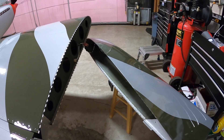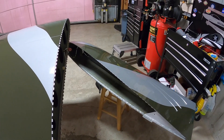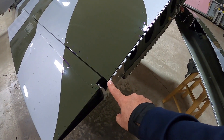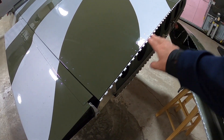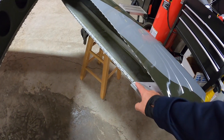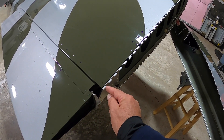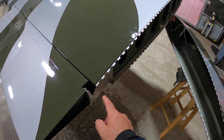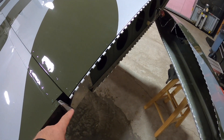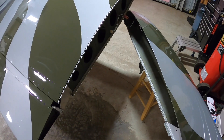It makes a pretty clean attachment — it took me about 15 seconds to remove those. For installation technique: once I get the wingtip up in place I start the hinge pin. The first eyelet starts on the aluminum side, so I can start the hinge pin in there just a little bit — not so it impedes the opening, just so it's sitting there. Same thing with the bottom. Then when I put my hand up and get the fiberglass piece in place, both pins are already started and I can get it slid in place with one hand.